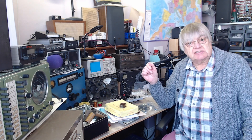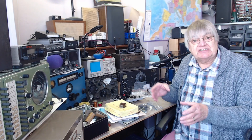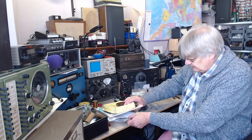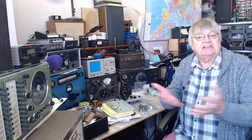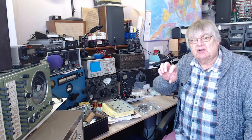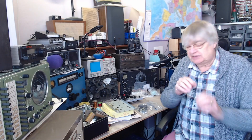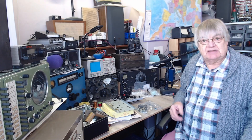Apparently a lot of agents lost their lives because they were simply listening. The reason they went over to a metal box — rather than the wooden box — was to screen the whole thing and really cut down the radiated RF from the receiver when it's oscillating. You've got maximum sensitivity when you're just either side of that critical point, so you wanted to back off slightly rather than have the thing oscillating too much, which means you're using it incorrectly.